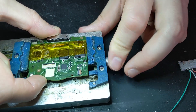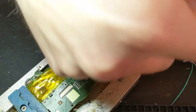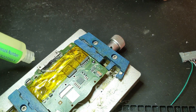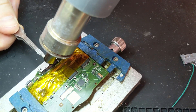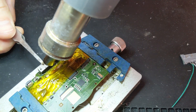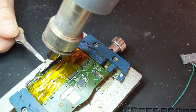I have done that before when learning how to change charging ports on this. The charging port replacement is something I've done multiple times, and it does take a bit of skill. The PCBs on these iPods are really thin, so it's very easy to mess up if you don't know what you're doing. Unfortunately the port has to be soldered directly onto the board — not every device is like that, but iPods are.